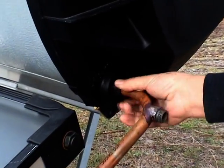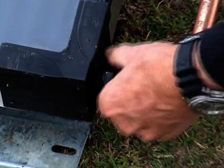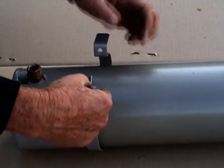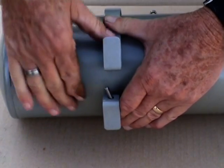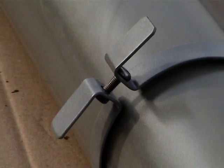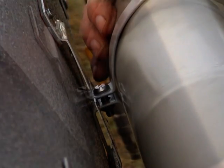Fit the HeartStat cold pipe assembly to the tank outlet and the collector inlet. Do not over tighten. Fit the reservoir tank loosely in the clamp brackets supplied with the fixings in the heat sealed plastic bag, in approximately the correct position to fit the mounting brackets on the rear of the tank. Slide the clamp brackets with the reservoir tank fitted into the mounting brackets on the rear of the tank.